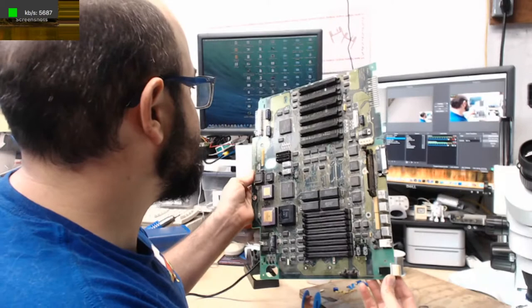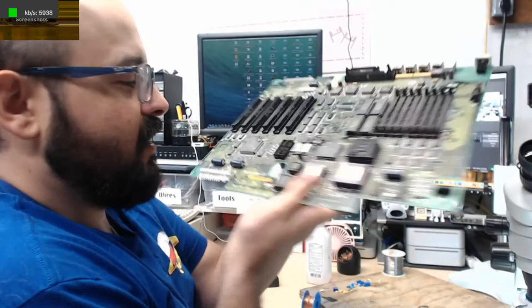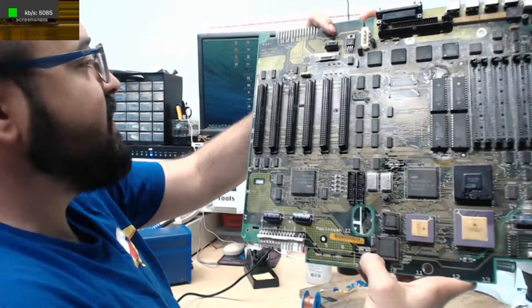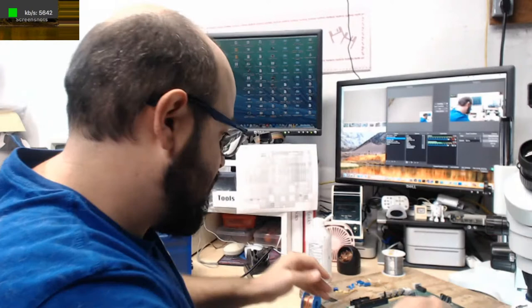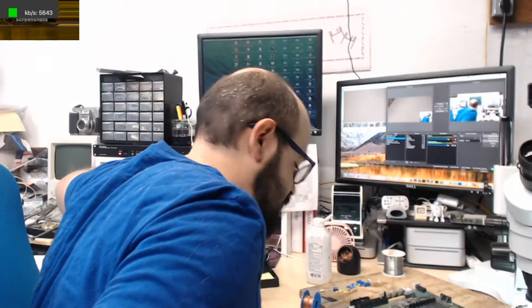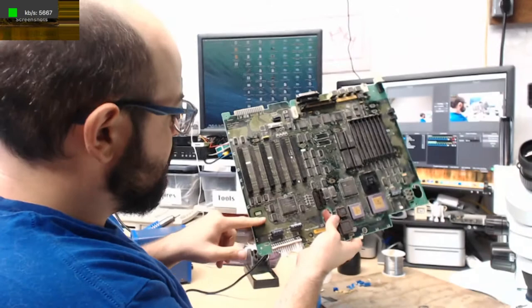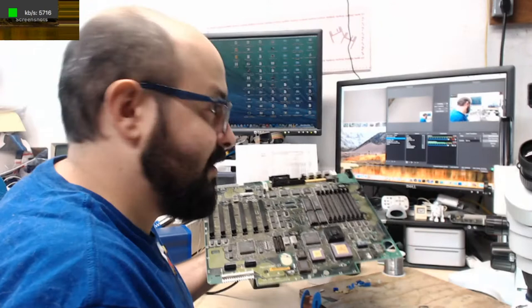I did notice something interesting, Bruce, and I didn't print out the text version of your guide, so I can't tell if you note it on your website. On the bottom of this is a revision B board, I believe. There is one capacitor, C19 here. But on the guide that you show, you have three capacitors there, which are C122, 117, and 114, maybe? Those may be incorrect, but that picture looks very different from mine. I don't have any RAM chips here, or memory chips, whatever they are. So, different revision board, I'm sure.